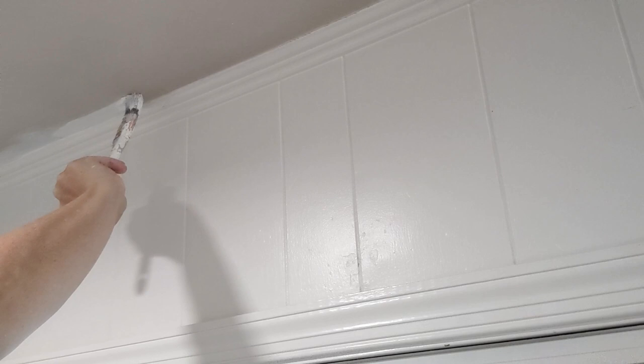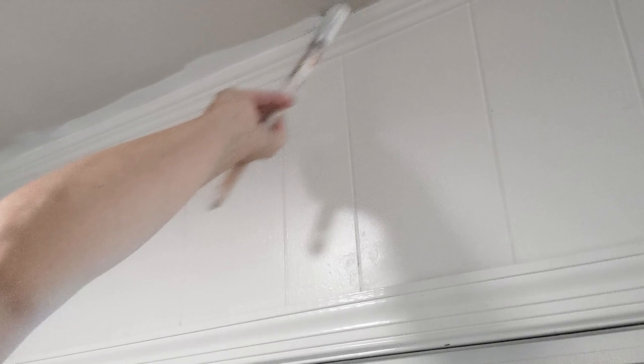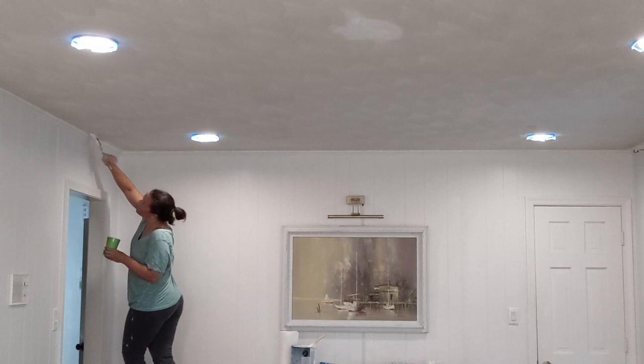If you're going to be cutting in around the edges of your ceiling without using painter's tape, here are a few tips that will help you get really clean, crisp paint lines. First, make sure you don't overload your brush with paint — you want it wet, but not dripping, because that just makes the paint harder to control. When you start painting, start with your brush about a half inch or so away from where the ceiling meets the wall, and then slowly move it closer to the line. Make sure you don't apply a lot of pressure to the paintbrush, because that's going to cause paint to squeeze out and spread where you don't want it. The main key to getting beautiful paint lines is just having a steady hand, finding the right angle, and taking it slow. It's also helpful to keep a wet rag nearby for quickly cleaning up any mess-ups — paint's actually pretty forgiving when it's wet.